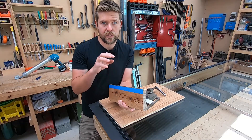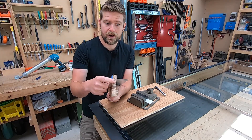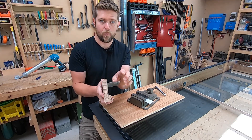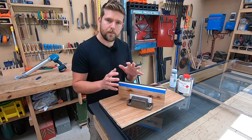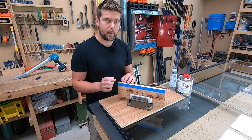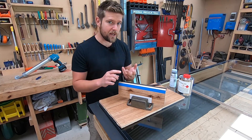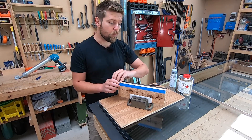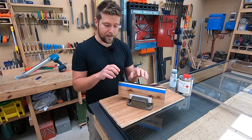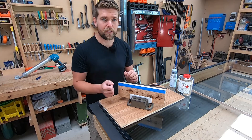So let's have a look at the bonding process I've used to stick the glass onto my windows. Here we have a cross section of my windows. I've got the Victorian ash that I machined up, I've got the brass angle capping the piece of timber, and on the back I've got my Colourbond weather strips adhered onto the back of my window. The first step was to tape up the polished brass on the inside of my windows, then prep the brass by sanding it back to remove oxidization and impurities, and then washing it with acetone to remove any sanding dust, finger oil, or anything else. The sanding also helps key the surface to give a better bonding surface for the adhesive.